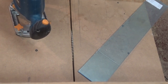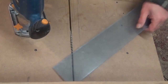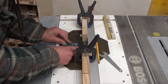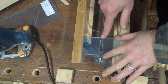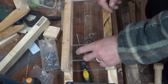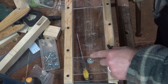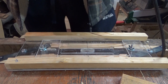What I need now is a couple of pieces because these are going to be my stops. I'm going as wide as the plate on that because that's what's sliding in the jig. I've also got to cut some slots in them, so I'm going to have to set the router table up. These fit on there like that and basically allow me to set a stop — that's how these will work. Then I'll flip them over and drop a touch of super glue just in the screw heads. Let's set this up and give it a blast.